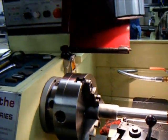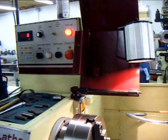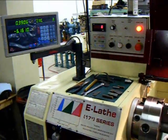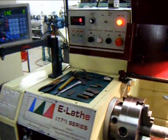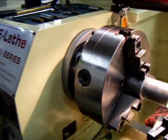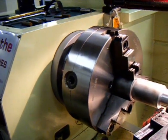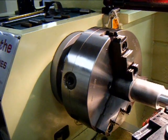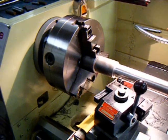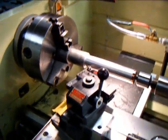This particular lathe is running off of residential power through an AC inverter. I've never had any problems with power. The main thing is it repeats well, and even with the stock three-jaw chuck that comes with it, you can chuck up different materials and it'll be within thousandths of being on center. There's very little need to chuck up with a four-jaw — within a thousandth is close enough.